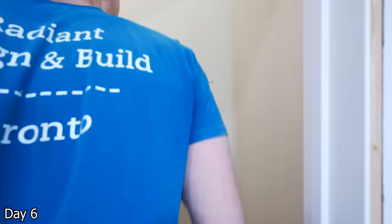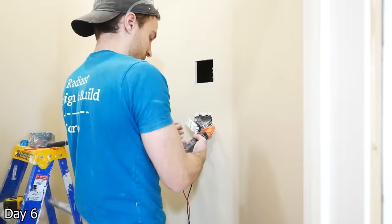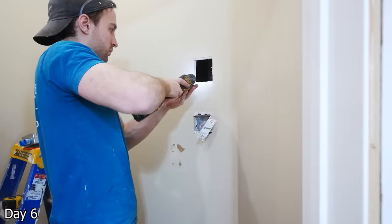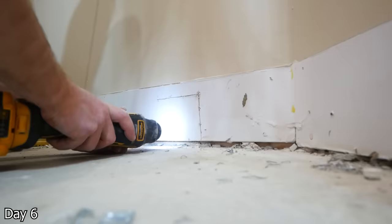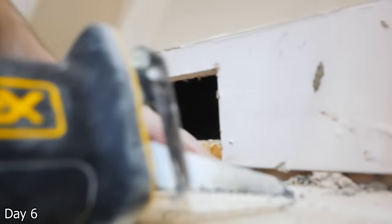Adding in the rough-in for the floor heat. This is a four-by-four deep metal box that I cut out, and then I'm going to bring a wire from the existing general area power up into my box to supply the floor heat. Now I'm not here to tell you about your local code and whether or not you can do this. However, in my circumstance, my floor heat's load was less than three amps, and the existing circuit at its highest point I only measured one amp of draw on it, so I felt more than comfortable sharing this.